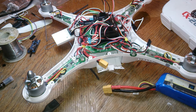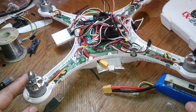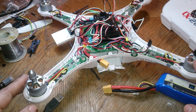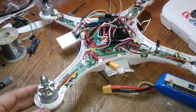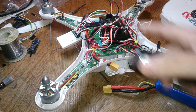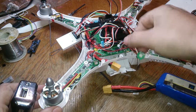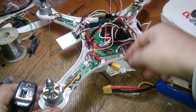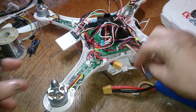Noticed I got lazy and replayed another video I did with the ESC calibration, but that's fine. So let's say after you do the ESC calibration you can't do it because the motor just continues to beep. Here's the final thing you can try just to see if we can get it to work. Again, it's the same process. Make sure you don't have the power module installed, or this cable here coming off the CX20. Unplug this from your receiver.